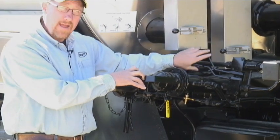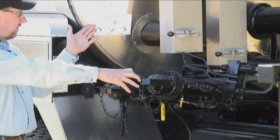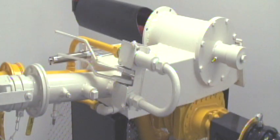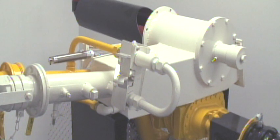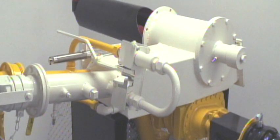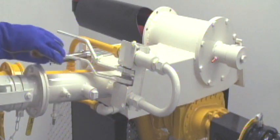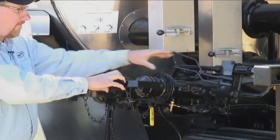These valves here are the hand spray valves. There are very simple operating instructions on the back of the tank with the tag. When you want to hand spray, you move the valves over. When you're done hand spraying and want to suck back, move the top valve back and now you're in suck back mode for the hand spray. When done sucking the hand spray hose back, move the bottom valve back to the left in the start position. That covers all the hand spray functions.